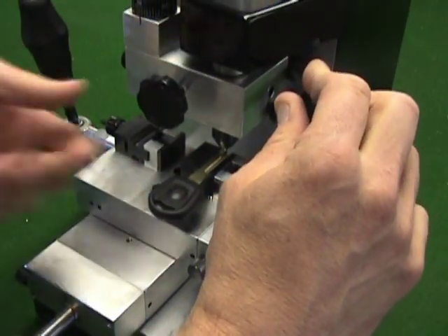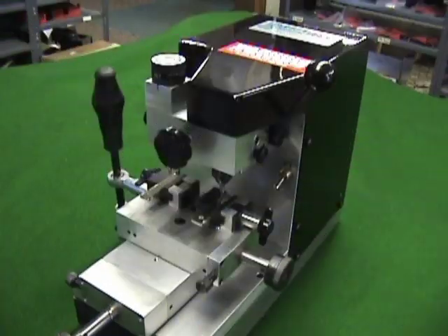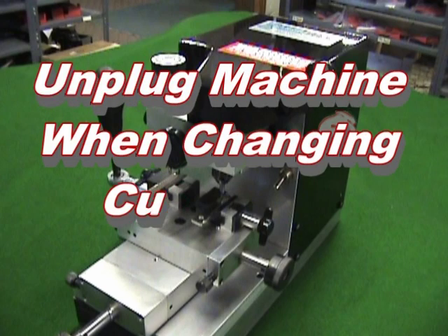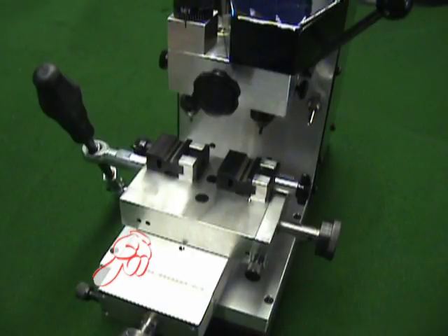On the right side of the machine is the feed handle, used to raise and lower the cutter head assembly. The power switch is located to the right and behind the key vices. We recommend that you unplug the machine anytime you change cutters, vices, or guides to prevent inadvertently turning on the machine. In the front and to the right of the machine you will find the rod lock knobs. When engaged, the lock knobs turn the Sidewinder 2 into a code cutting machine. Engaging the knobs requires only screwing in the knob.